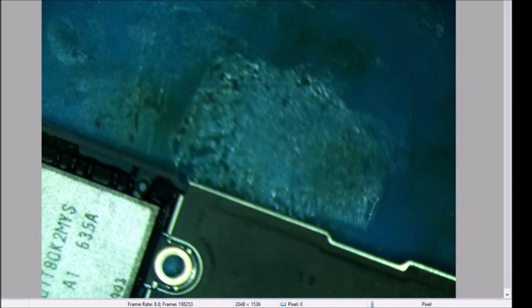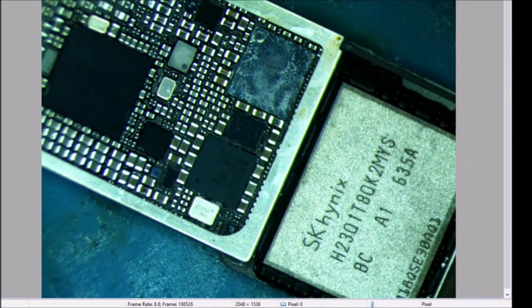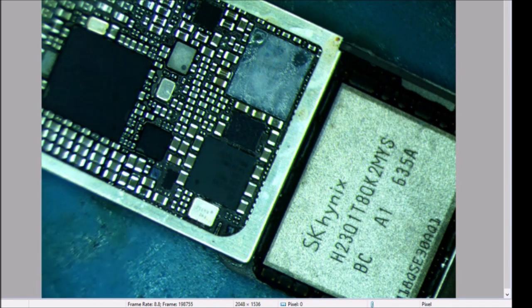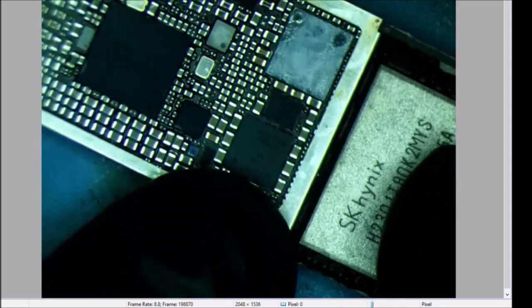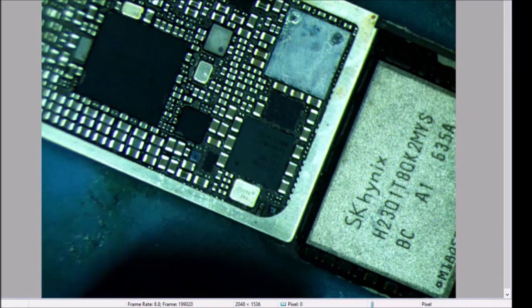We're gonna let him cool, and we're gonna test this line in diode mode. And I'm getting a much greater resistance to ground. I was getting like 46 or something. I'm now getting more than that. I'm getting a 0.213 for diode readings now. I was getting like a 0.08 or something really ridiculously low. So if I were to speculate, my problem the whole time was the Qualcomm PMD9645. It's really unfortunate that I took the time to do the baseband when I probably didn't need to. I really risked a lot, but it was because I was convinced that that guy was good.